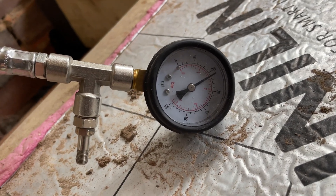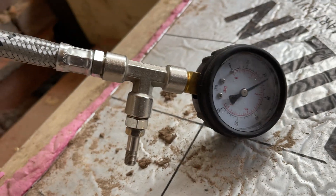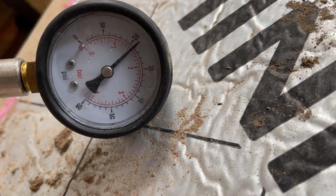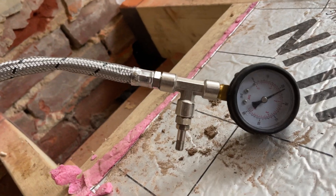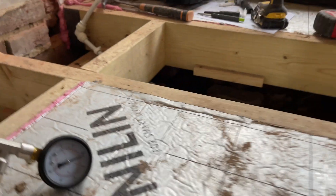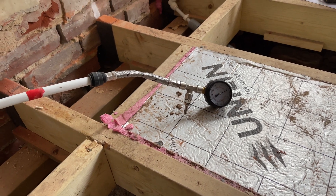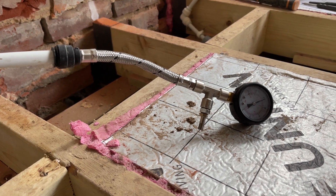After tightening up the nuts on the gauge for a while, there was no further air escaping, and the push-fit was pushed on as far as it can go. The pressure has stayed like this overnight, so I'm happy. Overall for £15 it's not bad — just check that it doesn't leak sooner than I did. Put it in a bucket of water and check for bubbles before you start. If there are any leaks in the pipework it hisses like a snake — so watch out for snakes and watch out for bubbles. Thanks for watching.